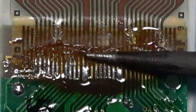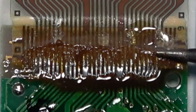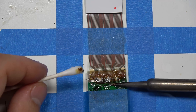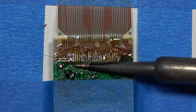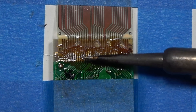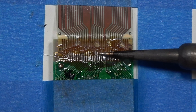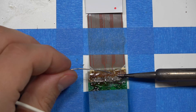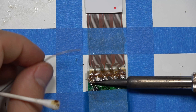The next aspect is cleaning up the plastic. Also note there are little holes on the PCB where the screws go — solder can fall in there and you'll need to remove it before testing. We're now flowing down again, and all that black goop is melted plastic. Once it's hot and melted, take a q-tip with isopropyl alcohol and wipe the melted plastic away while you're working. The tip I'm using is nice and long — like a standard tip but much longer, almost like a needle tip but not fully needle — so we can gently wipe it down. If there's plastic stuck on the pins, add a little bit of solder to help remove it.